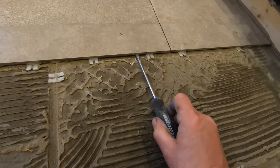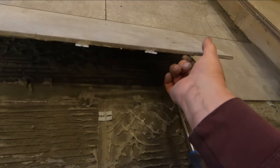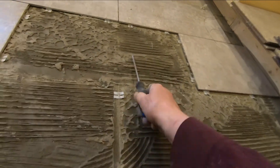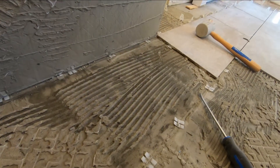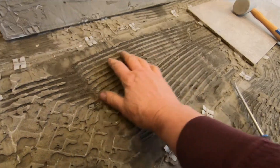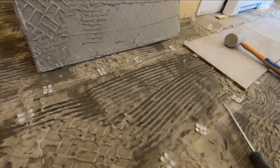There's a gap under there. I'm just going to pull on it real easy. Huh — that came right out. Absolutely nothing holding that tile down. You can see where I had to trowel this down, and immediately back buttered the tile and put it on it, but it didn't even compress it. You know, you push down.